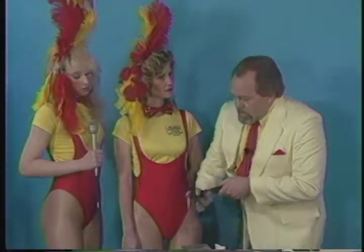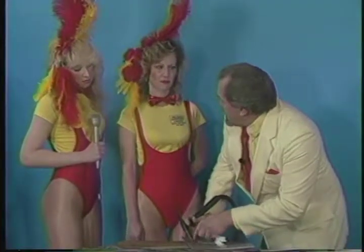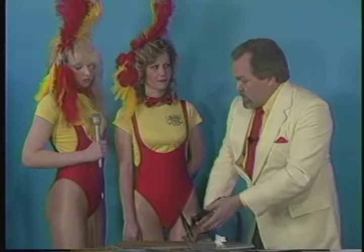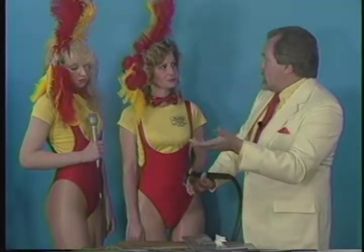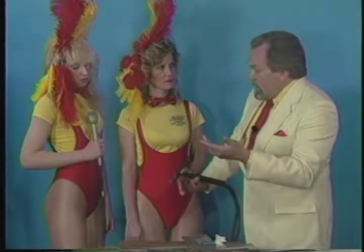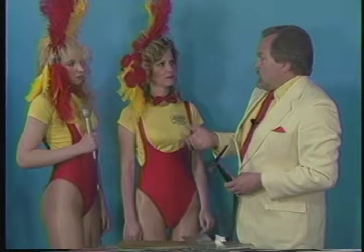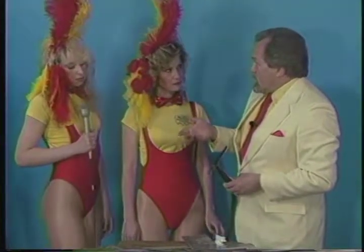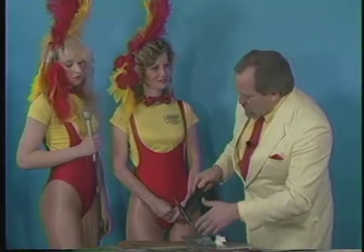So if we are welding in this position and we want to flood the weld area with helium, the helium is flowing away very rapidly, so we have to run a fairly high pressure to keep a lot of helium on it. Okay, helium also, by the way, is an inert gas. It doesn't burn or react with anything. So although I want to say this now, welding companies very often do buy tanks of helium also, as well as argon, when they do overhead welding, because then you want the helium flowing upward. But argon is heavier than air, so it aids when you're doing a normal downhand weld.